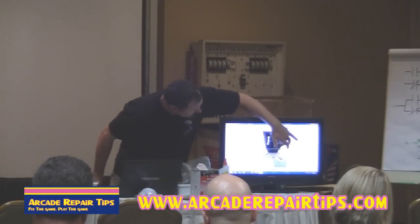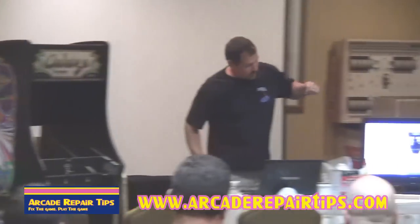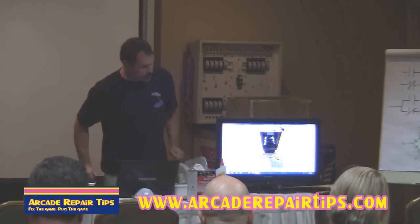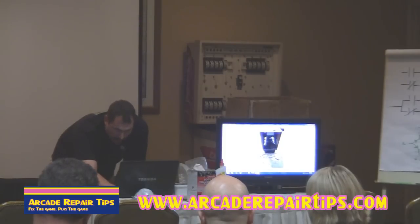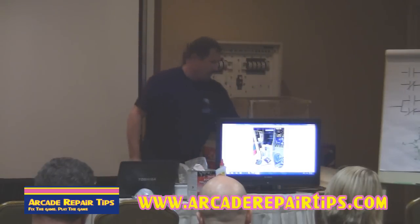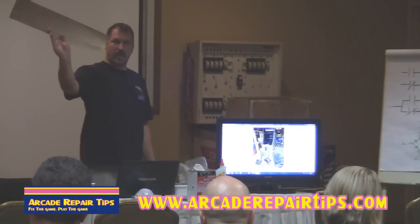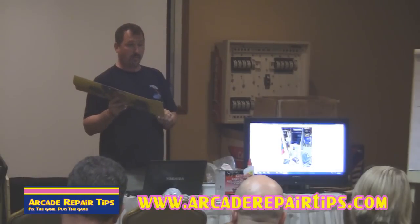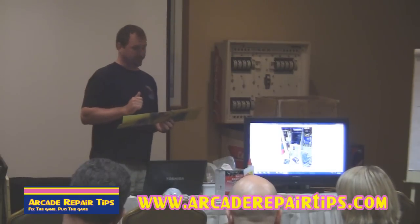On the sides — Miss Pac-Man's side cabinet front and bottom back are particle board, while Galaga is dual plywood, meaning they've taken two pieces of plywood wedged together making them extra strong. The only problem is you get separation. They also put laminate on top. After taking the valuable parts out and sanding, you'll find knots, holes, and where they glued the laminate together — you'll feel a line. They do a good job with sealant and two coats of paint, but unfortunately after 30 years the glue just doesn't adhere anymore.